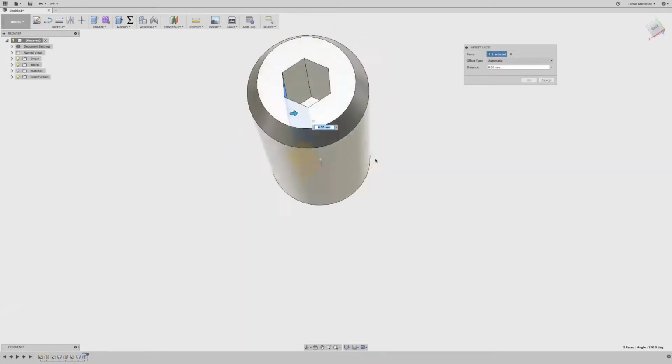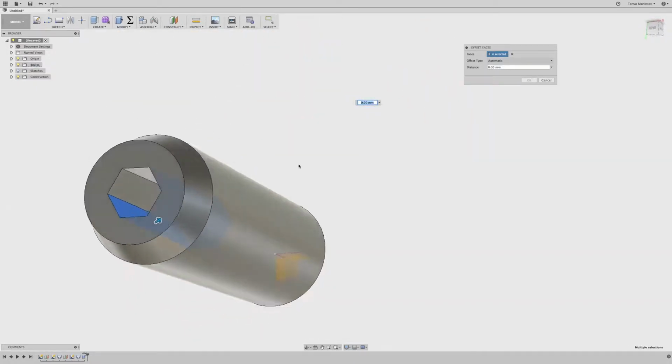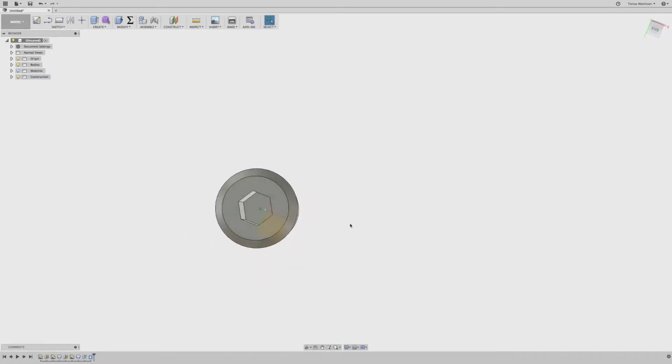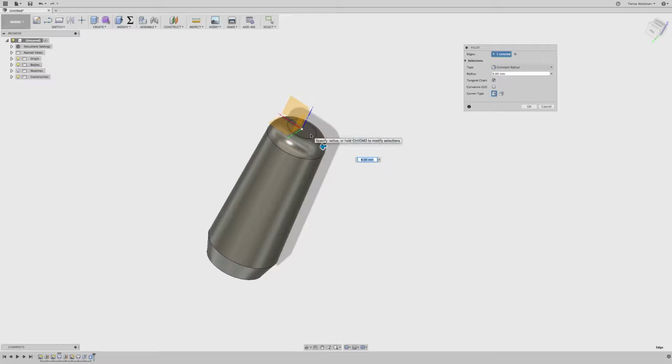Now I'm just going to make a little play there so that the bolt, I'm going to print it in ABS, and it's going to shrink a little so that at the exact size, the bolt is not going to fit. Minus 0.1, and it's going to be on both sides, so it's 0.2 total. Now the bolt fits in the hole. And then F for fillet, just a small, nice round. I don't want to make it totally round because this end is going to be against the build plate, so it needs something to grip on it. So I think that would be nice.